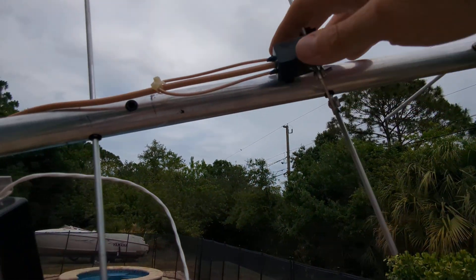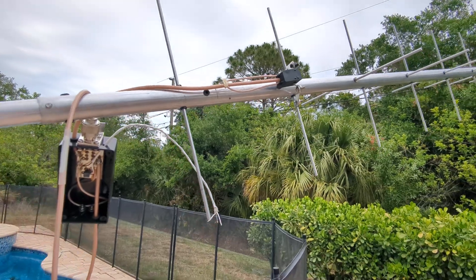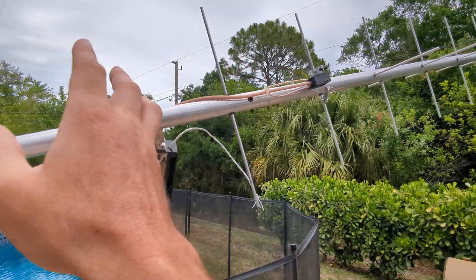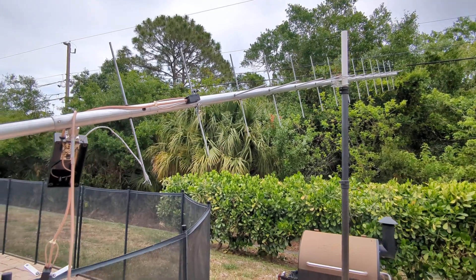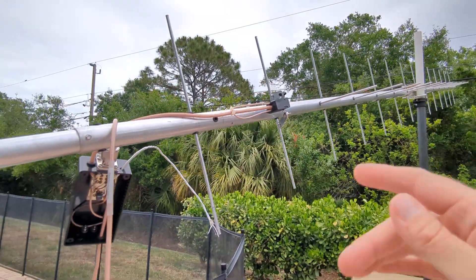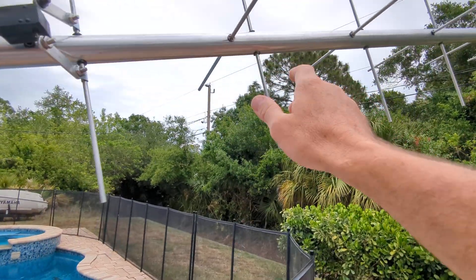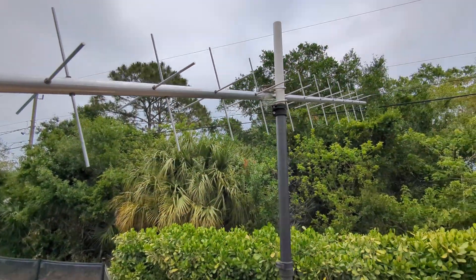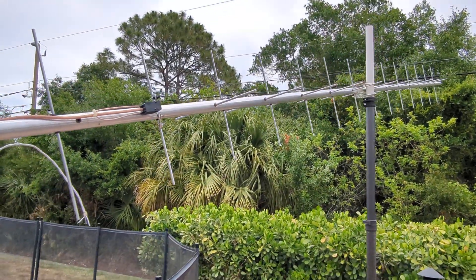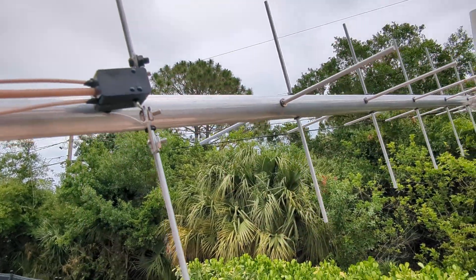This was originally the reflector and the driven element would be under there, but that's going to be hard to fit because everything is so close to the boom. If I flip it, the matchbox has to go either here or here — it's supposed to be in the back with cables running off. My question is: do I put it all together like this? I'd have to take every element out starting here and move them all forward one position. Those push nuts don't come off easy — you have to hammer them and yank them off with a hammer claw — and I'm running out of them if I break any.